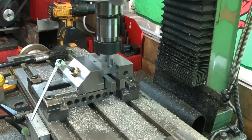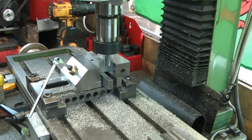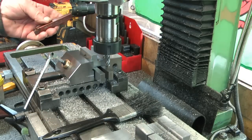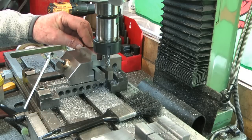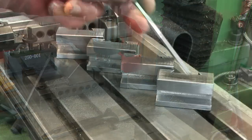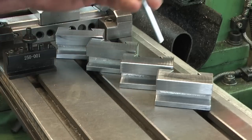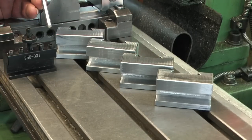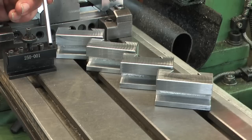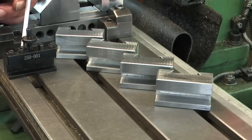I'm going to try it in this one in a moment - hopefully our tool will fit in there now. Lovely - just a little bit of rock - she's in there. Okay, all four done. You saw how I went about it and they all fit nicely with the lathe tool. I've tried a couple of the other 12mm lathe tools and they all fit nice. So next, 6mm grub screws - four needed, to locate them in the top. The distance back is going to be slightly different because of the slot width.